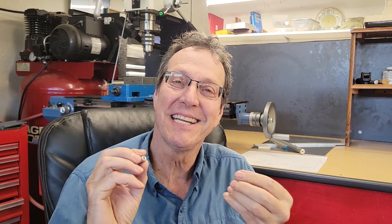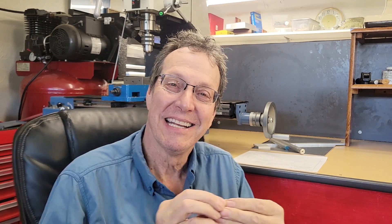We finished our very first parts on our 30cc Wallaby model engine. Let's go ahead and get back to the lathe and make the tall standoffs. They're going to follow the same process as the short ones, except they'll be a little bit longer. We're going to put some decorative curves in the middle and tap some holes in the end instead of drilling all the way through. Alright, let's get back to it.